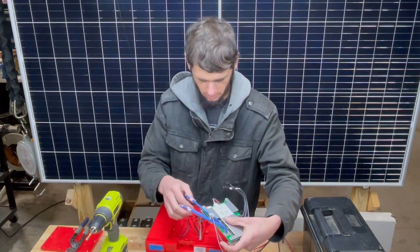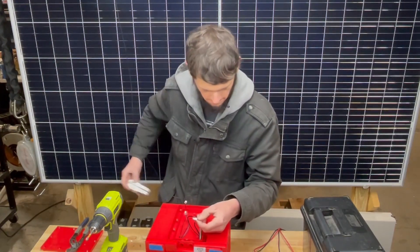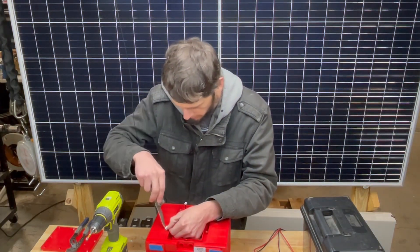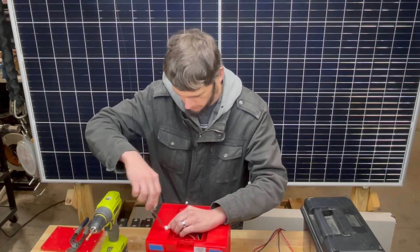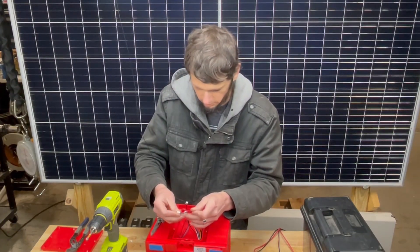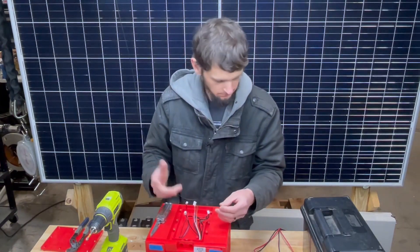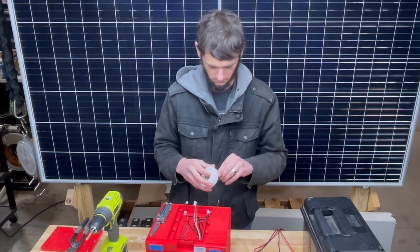One option is that these pins are typically removable from the connector — I wonder if I could pop them out. I'm starting to mess with the sense leads here. If I pull out two of these leads they can short with each other — there are no fuses — so I need to be super careful, which means I should grab some electrical tape right now. Yes, I can pull them out. I don't want to plug this in backwards into the BMS, so I'm going to have to pull all of these out and put them back in. Today I'll be using white tape — it's still electrical tape.